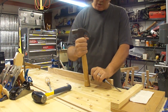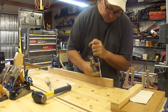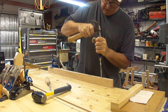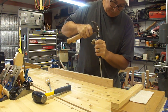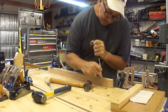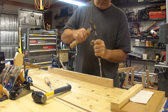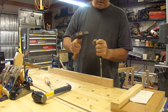What I don't think you should do: I don't think you should pick up a carpenter's hammer, for several reasons. One is the small striking area puts some concentration up here — you're looking up here and concentrating on a good strike. That takes your mind and focus off of what you're trying to do here. So that's a bad thing. Secondly, a glancing blow is going to do damage both to your tool and possibly to your knuckles, and it's just not recommended.